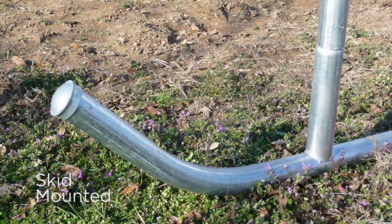There's a skid-mounted type — this was a University of Arkansas tunnel. They need to be a little thicker steel so that they don't bend on you, and curved up like that so they don't get stuck in the ground when you're trying to move them. Some kind of a winch or people hook tractors to them to move them. But these have their limitations too — don't try to move too fast over too undulating ground, and take your time.